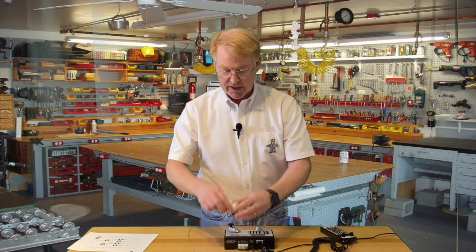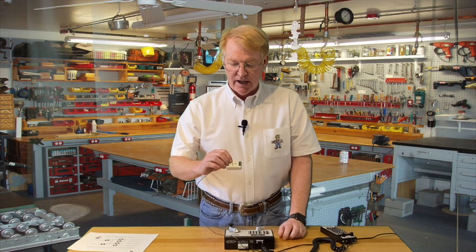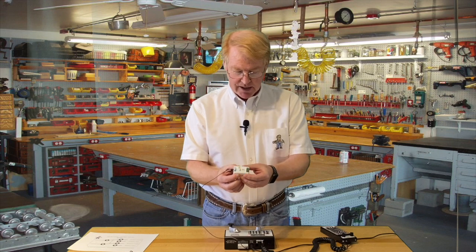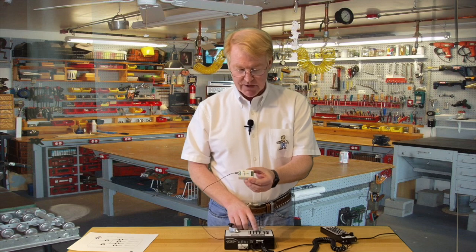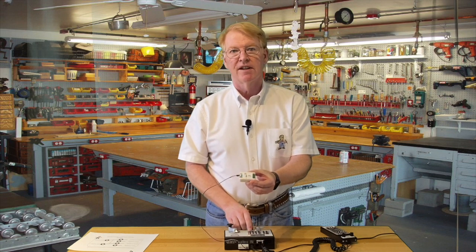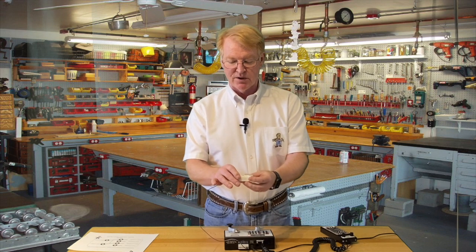I'm going to hold it up so you can see it better. I'm going to press and hold the select button, and after about 8 to 10 seconds the light will come back on, and you release the button and you'll notice that it's flashing. The way to program the new address is to hit switch — I'm going to use 456 — and either thrown or closed activates it. It blinks, and now that's the address for this device. It's that simple.